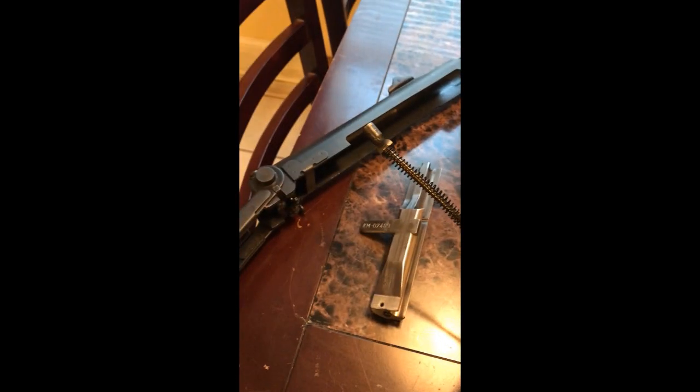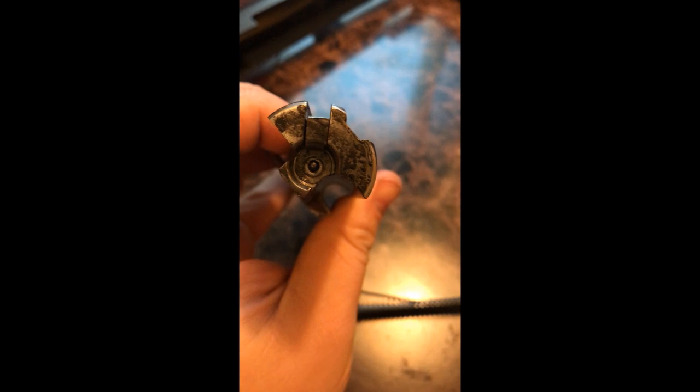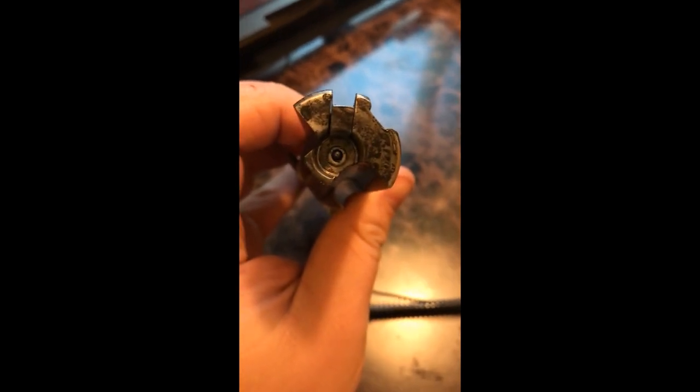I also modified the ejector somewhat. I'm going to stop for two seconds and take all this out so you'll be able to see it. So here we are — this is the ejector. I slightly modified it; they change it over the stock one. The ejector itself is lengthened for the 9mm, but I had issues because either it's undersized or just too sloppy. It's supposed to ride in that groove and catch the edge of the casing and kick it out, but a lot of times it would just move to one side and completely override the casing and not do its job.